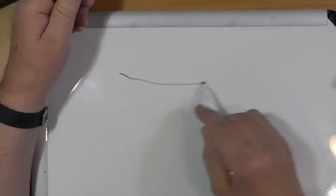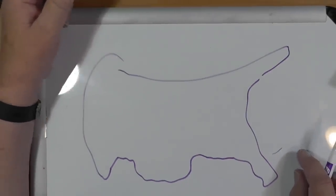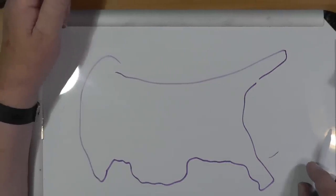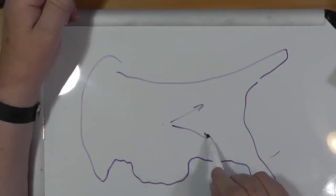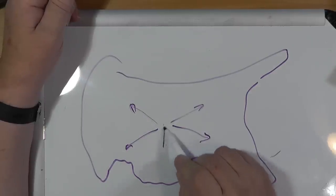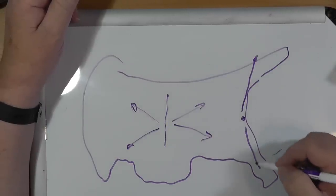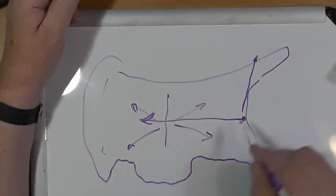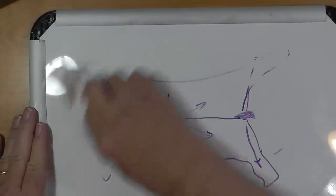Now, if you want to get that last little half a dB of presence, it depends on where you live. Let's take just the United States — my wife got all the talent; as part of our marriage vows I gave her all my artistic talent, which you can tell wasn't much. If you live here, most of your activity is going to be this way, so you would put your dipole north and south. If you live here, you're going to have activity this way, this way, and over to the corners — you probably want to put it east and west. But with an inverted V, the difference isn't much.